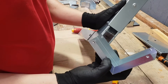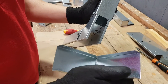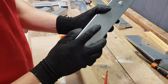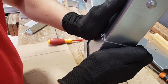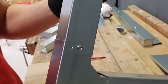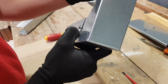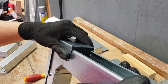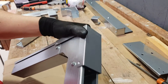So we've got the corner fixed onto the two pieces of trunking. We'll look at how the lid goes on — it simply clips on and the little dimples just snap on, holding it in place. On the side that's already got the lid on, the lid clips over and it's actually the lid on the straight piece of trunking that's holding the lid on the bend in place — quite clever. On the side that doesn't have the lid, it's still a little bit loose, so we need the lid in place on the straight pieces of trunking to get the lid to sit on the prefabricated bend nicely.